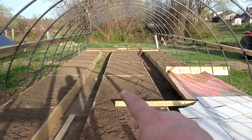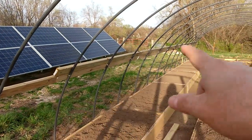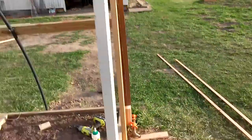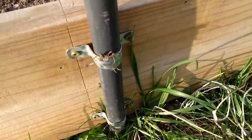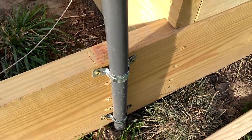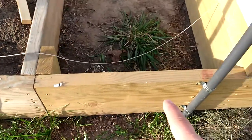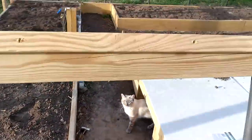The layout is three foot, four foot, three foot — about 14 feet wide and 50 feet long. We have hip boards here, and the finished product will be a one-by-four with a one-by-two. Everything PVC is clamped with saddle clamps just to keep them in place — they're pretty rock solid. We'll see over the seasons if those hold up; they're easily replaceable, and if screws strip out we can just move the clamp down. We're going to put two-by-fours horizontally between the uprights to give us a flat surface to attach the plastic.